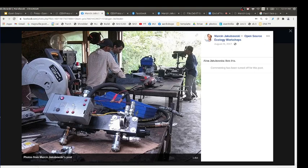And with this one, we had the box where you actually control it up, down, left and right with the buttons as well. We got rid of that because we just put in a reset button. When you start, you want to make sure you lower your cylinder. If there's high pressure, you lower the main cylinder and retract the drawer so that everything is open. We controlled that with the manual buttons, but we didn't find a great use case, because that's only when you're messing with it or it gets stuck. So we just said, let's just zero it, and that's all we need. It simplifies the controller, removing a feature we didn't find much use for.